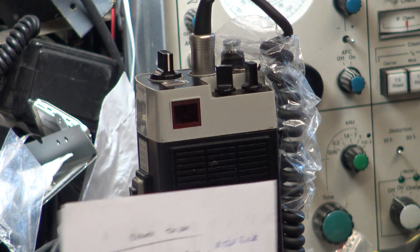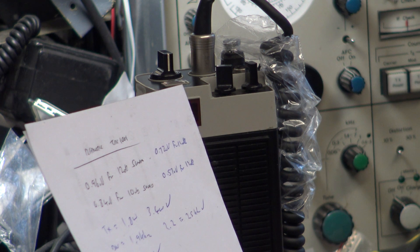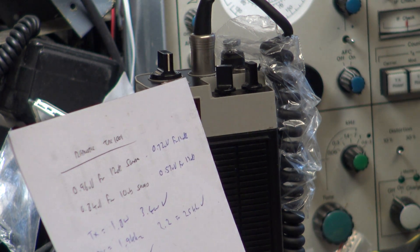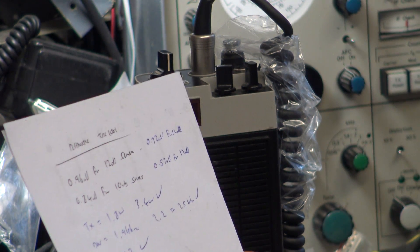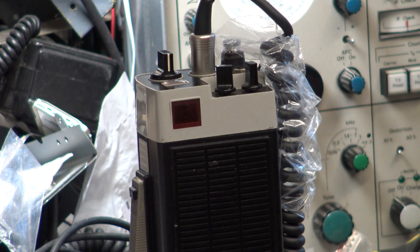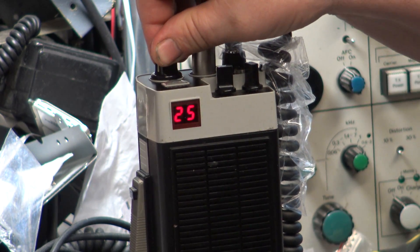There was no video because when I came to edit it there was no sound, so you can't have the one-hour video of me repairing this. When it came in it was 0.84 for 10 dB SINAD; it's now 0.57. Minimum transmit was 1.8 watts; it's now 3.4 watts. Deviation was 1.9 kHz; it's now 2.2 - that's just an adjustment. It came in on frequency, but there was no transmit whatsoever because of the burnt-out voltage regulator.